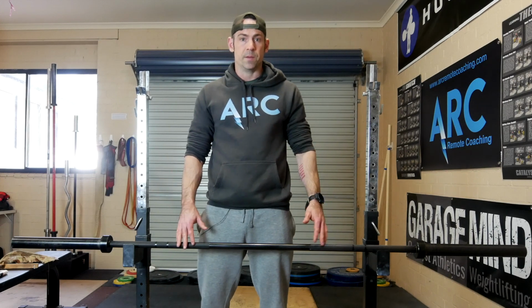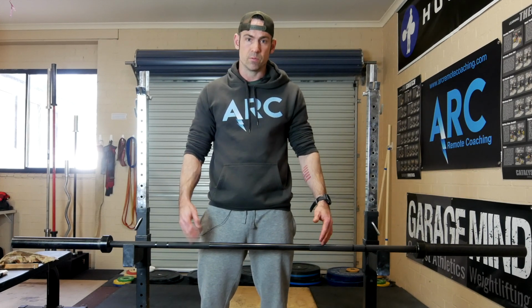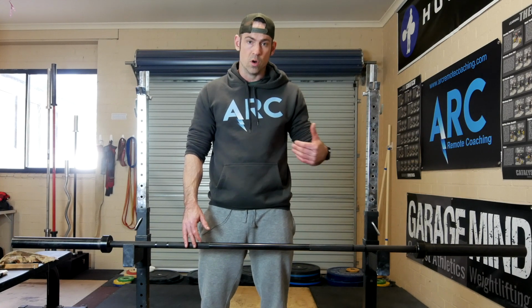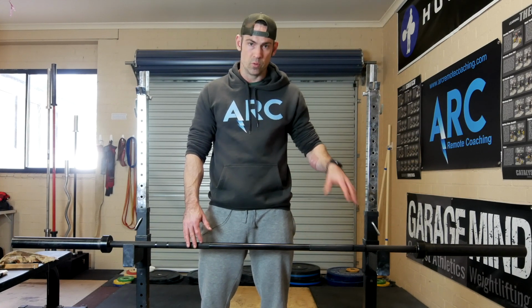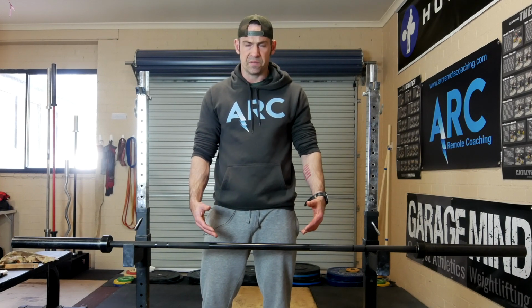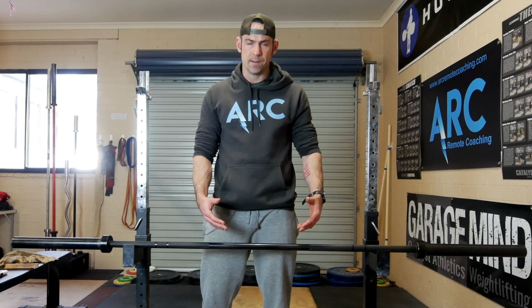So what we can do from here, well, one, we can go back to scrubbing with our brush and oil. Or two, we can apply another coat of our acid bath to try and pull that last bit of rust off. Now you might think, taking the rust off, that's going to compromise the bar.